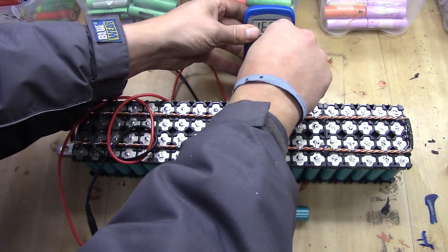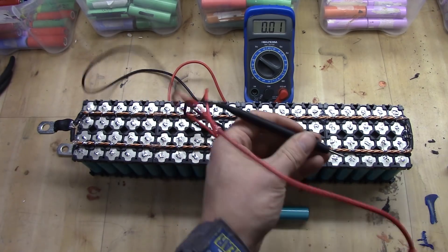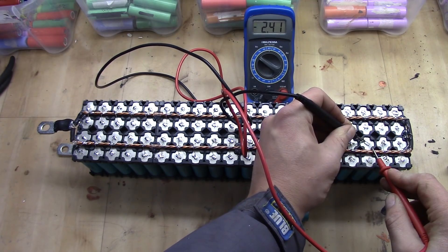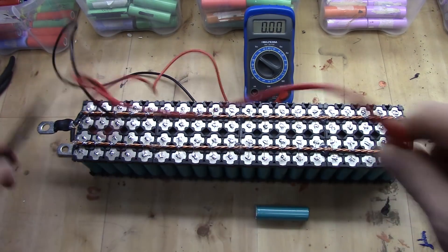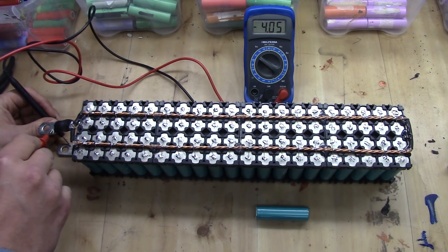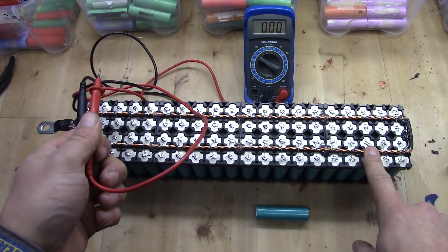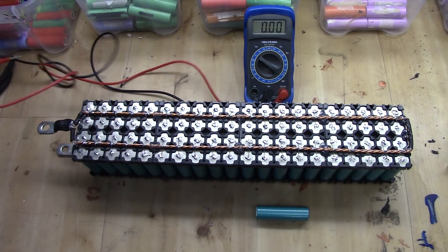Today we're going to tackle one of the cells here that I mounted that is faulty. It's faulty in that the measurement on the cell, as you can see, is 2.4 volts. Meanwhile, if I check any of the other cells — for instance between here — I have 4.14 volts. So this cell we have here, we can simulate that the fuse has blown and we are now about to get rid of it.